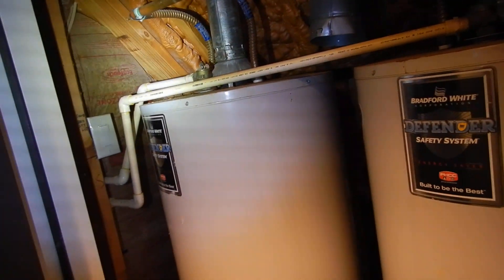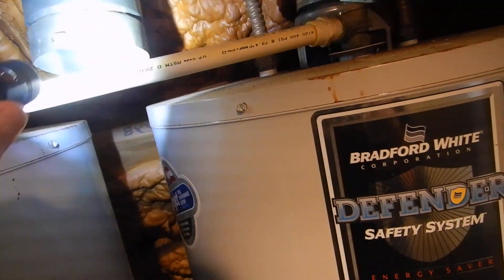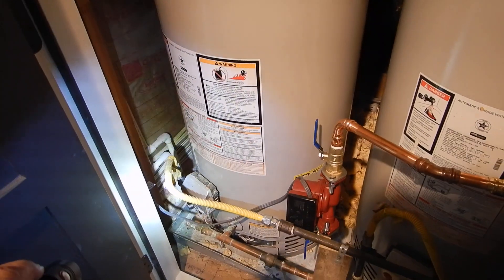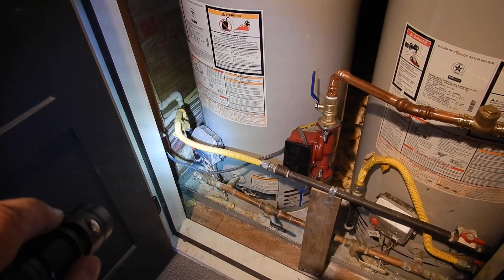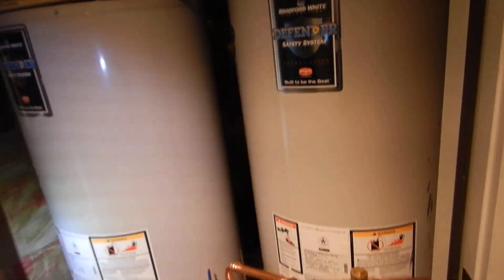This piping should have an air gap in the same room as the water heaters. Per the City of Dallas and the uniform plumbing code, there should be an air gap on this piping in the same room as the water heaters. I'm counting five bends on these in the same room, and we haven't even gone through the floor or outside. It's mathematically impossible for there to be fewer than five 90-degree bends on the temperature pressure relief valves — there are too many bends on those.